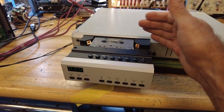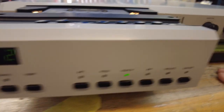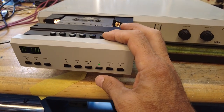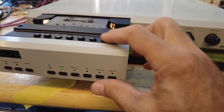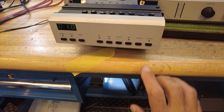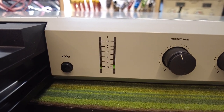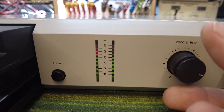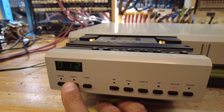I've noticed you can actually operate the deck while the drawer is in the out position. If I hit start the machine begins counting, and we can see some activity on the VU meters. Transport controls are pretty responsive. Now let me put in a blank tape — I can actually put it into record mode. I'll push both record and start, then pause it right there. You can see we've got a line input with a CD playing onto it, and I can adjust its sensitivity. There it is peaking at or slightly over zero dB.